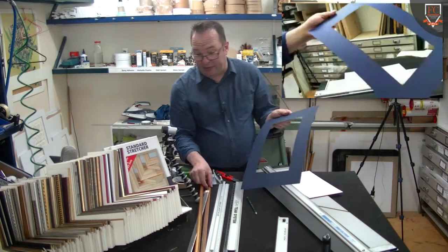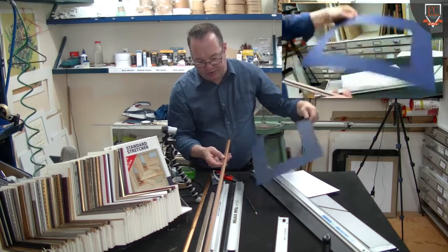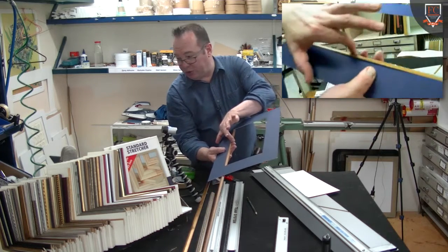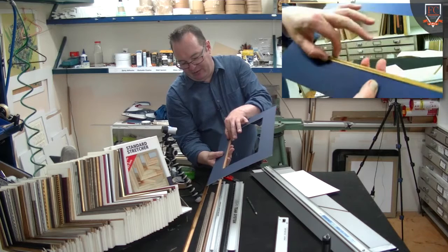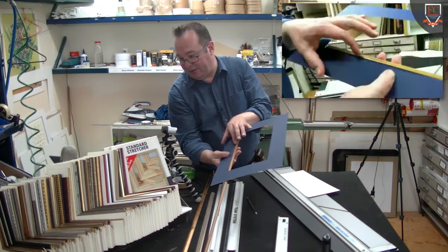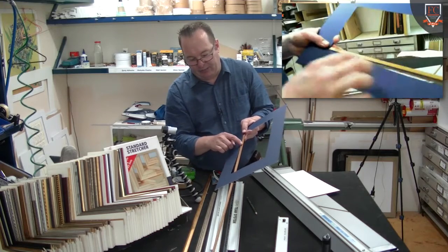In the example of the fillet itself, the area of the fillet that is going to show on the face of the window — you would deduct that measurement from your total mat calculation. So for example, if this would have been 75mm wide and the fillet itself is 7mm, I'd be taking 14mm off that opening size, or 7mm off each side, so I'd be cutting this narrower than that 80mm. And so when you finish up overall, you finish up with the overall size required, but you've made the allowance.